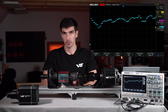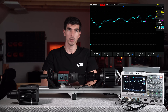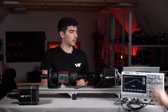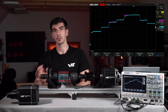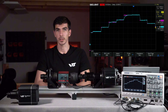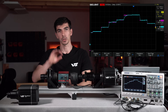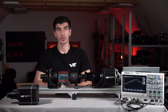Here you can barely see that it is two traces — it looks like it's all blue. But in reality, it overlays so nicely that you cannot notice it. If we find a sharper edge where the transition is higher, the step requested by the game is higher, then we can actually notice a difference. You can see how the purple trace is not able to immediately catch up with the torque requested by the game. This is caused by the limited slew rate — the inherent characteristic of the motor. You can also notice how the output torque nicely follows the blue line and achieves it without any overshoot or unexpected behavior. This is what you would call a nicely tuned control system.